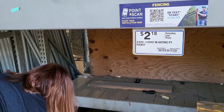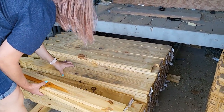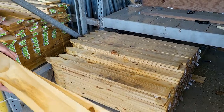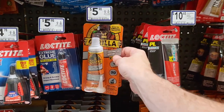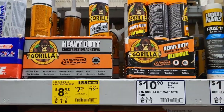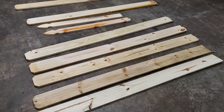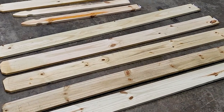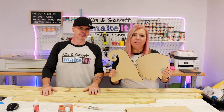These are the gothic pickets — this is where the three cuts come in. We cut these into three 11-inch sections; these are the braces that go on the bottom, top, and middle to help keep the board from warping. I found this Gorilla Construction Adhesive — it holds in 30 seconds, it's all-weather paintable, and holds something like 50 pounds. We had to lay the pickets out in the warehouse so they could dry up; I didn't want to paint or glue them while they were still so moist.